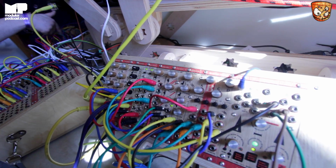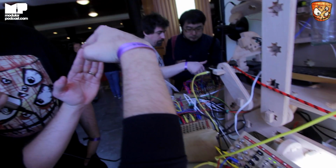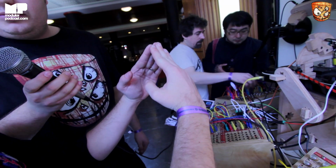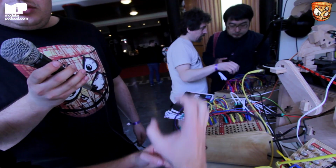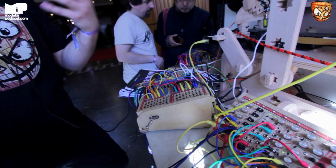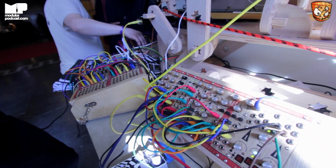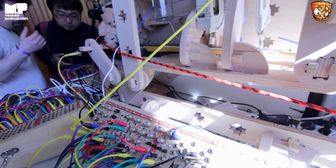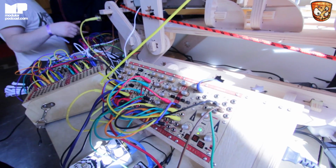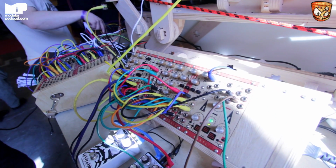Yeah, but if you pump up the attenuation on the VCA, it can go negative also, so you get only the quiet sounds coming through. Oh wow! So it's kind of like a negative, inverse compressor. Yeah, almost like an expander rather than a compressor as well. Exactly, and that just depends on the attenuation on the VCA.